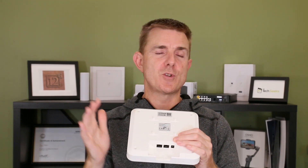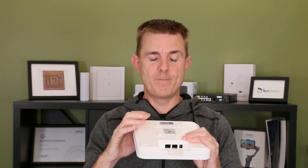You'll notice in the box there was no PoE injector, so if you are going to run this you need one of three things: either buy a PoE injector, connect this to a PoE switch — this runs at 48 volts — or you can run this on a 12 volt adapter or straight off your 12 volt solar system. Fantastic options in sheds, caravans, and other places where you might have a battery.